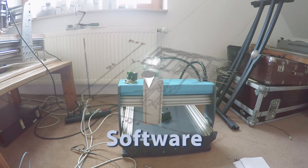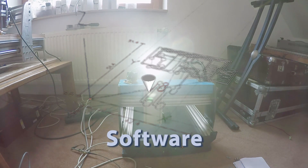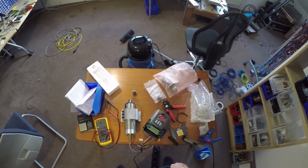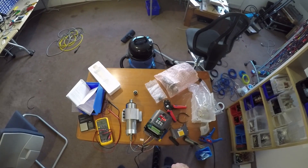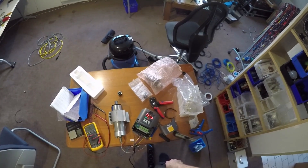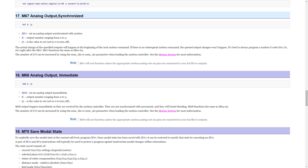The software preparation tends to be a little boring, so I'll rush through that part to get to the tasty electronics ASAP. The goal is to let LinuxCNC control the laser. A no-brainer solution would be to use the spindle PWM output or the coolant pump output, but because those are slow mechanical processes, LinuxCNC will always delay axis movement for an adjustable but never-zero time. The smart approach is to use M67, and the custom configuration for that looks like this.